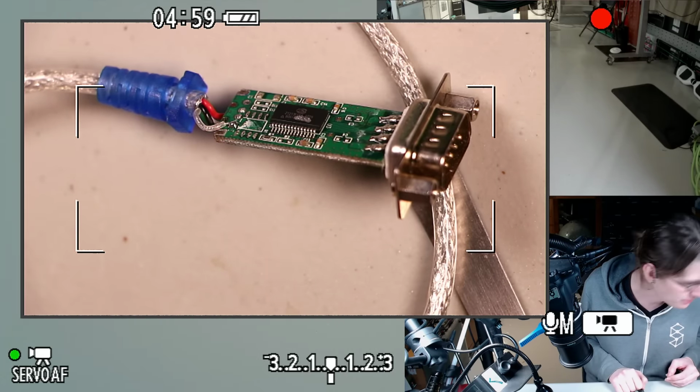I think I also had that transistor to turn off the VFD to help, you know, for USB spec reasons, you're not really supposed to use that much current until you ask for it. So, if I was making a board and if I had a microcontroller, I would definitely throw some kind of load switch on there so I could turn on and off the VFD. But at this point, I'm trying to keep the project a little simpler than that and just not even have a microcontroller and just use this modified serial thing. So maybe I'll just do that.